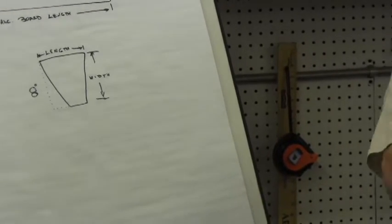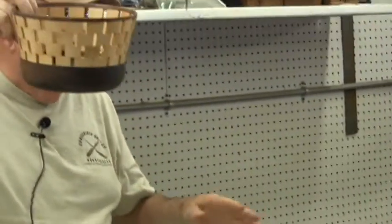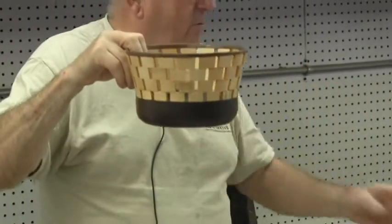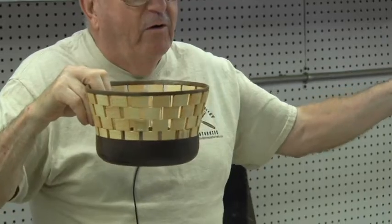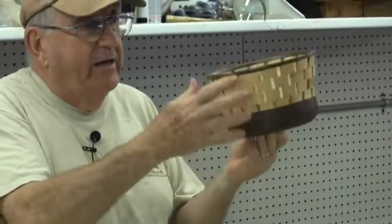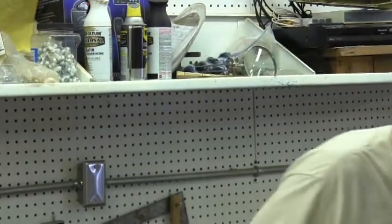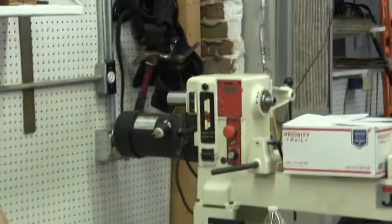And that gives me the capability to do this. It's all 8 degrees because it's open segment, so I don't have to worry with doing 0.69954. It turns out to be basically the same thing. You can make it any shape. Now, if you notice, when I get to this top ring, I don't have a heck of a lot to play with.